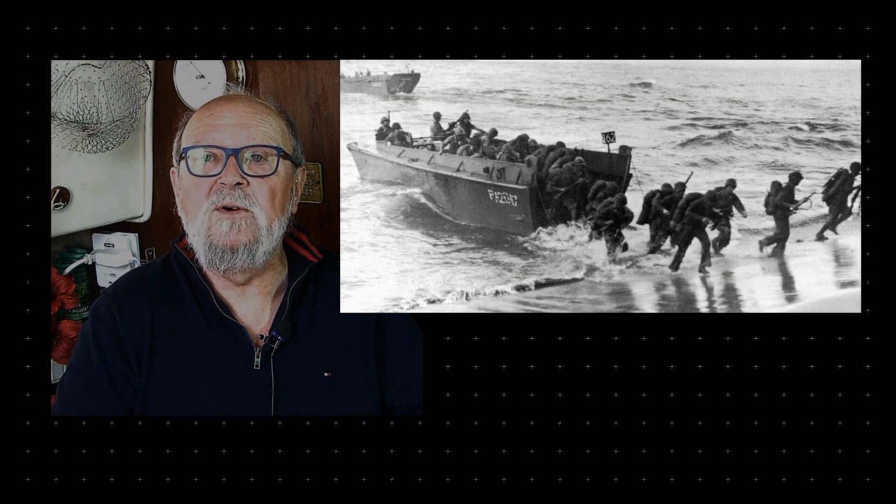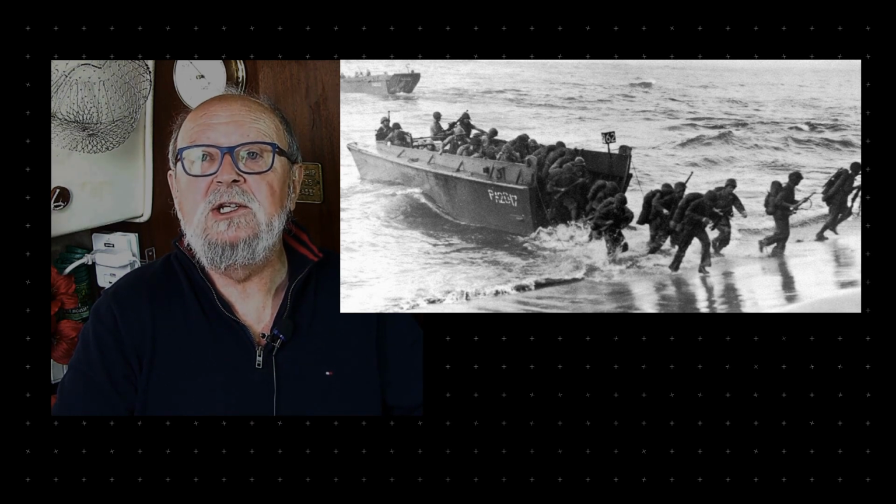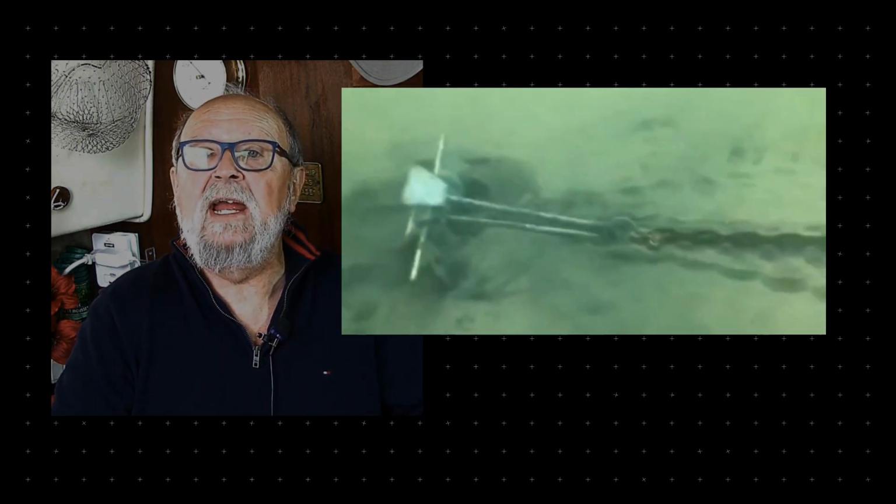Englishman Richard Danforth invented the Danforth pattern in the 1940s for use aboard landing craft. It uses a hinge at the bottom to which 2 large flat triangular flukes are attached. The hinge allows the flukes to dig in towards the bottom. The anchor is designed to bury deep into a seabed and once well set can develop very high resistance. It's lightweight and compact. It's a flat design that makes it easy to retrieve and relatively easy to store.